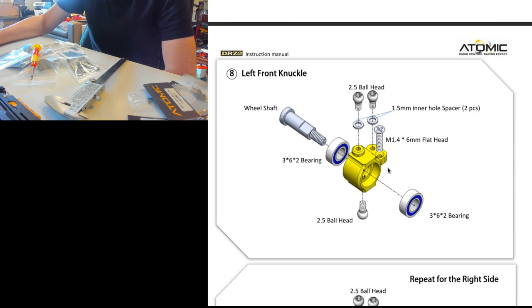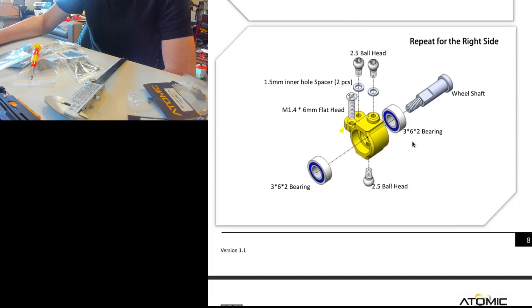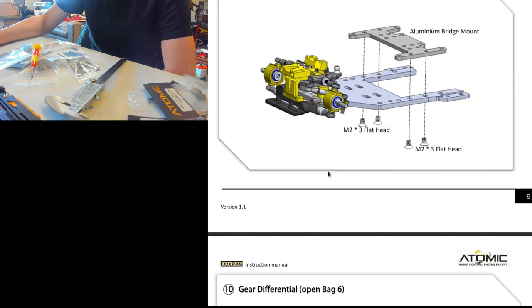There's reasons to do that, mainly with how the ball bearings behave under load. If you've got a spacer in between the ball bearings in the center here, you can actually compress them a lot to their maximum compression and have the ball bearings still freely rotate. If you don't, then they pinch in the middle and they start to rub. So I've got some wheels that are just slightly too loose that need these spacers internally. Okay, that's all relatively simple.